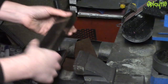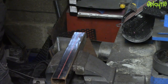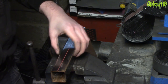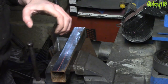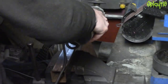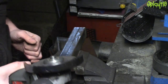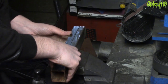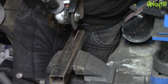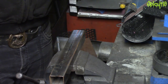Don't you need two? Yes, I'm just going to cut this in half. Close enough. Note: I raised the box section up because if you clamp it near the top and you cut through the top section, when it gets through it's going to clamp on the blade and that increases the risk of kickback. Even with the clamp at the bottom, it grabbed.